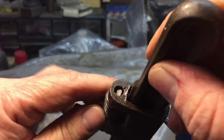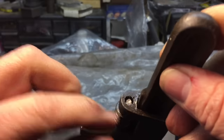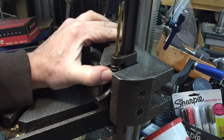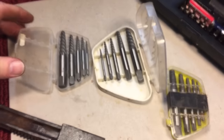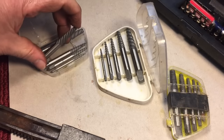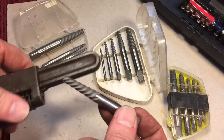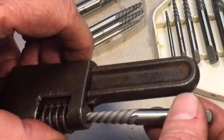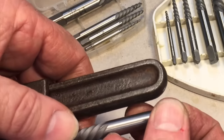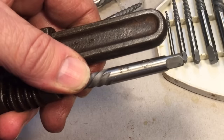Okay, now you see we got rid of all the side burrs that were holding it in. The pin is freely moving — you could just knock it against a piece of wood and it'll pop out. But let's say you have one that's stuck in. Let's see what it'd be like to drill this pin out. Okay, we drilled a small hole in there, and now we're going to use a screw extractor. Here's something I hope you never have to use, but you pick these up inexpensively at any place that sells tools or industrial supply houses. It's a screw extractor — you can see these teeth, it's a left-handed thread. You tap it in, put it into the hole, give it a couple taps with a brass hammer just to seat it, and then unscrew it. As this tightens up, it spins the screw the opposite way out.